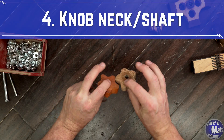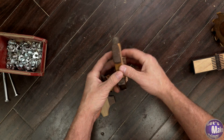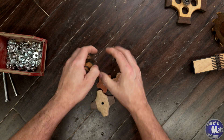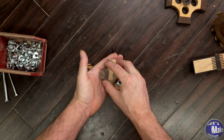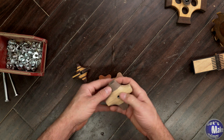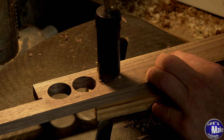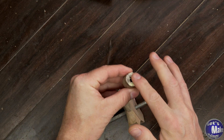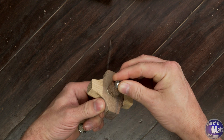One final thought: I didn't add a shaft to any of these knobs. A small shaft on the end allows you to direct pressure more towards the object you're clamping. With a wide knob it can be more difficult to clamp down and release it. Having a little neck on the bottom gives your fingers something to wrap around. If you want an easy way to make one, just use a hole saw — cut a small disc and you've got the shape and the hole in one step. Afterwards, just glue one side of the disc, slide a bolt through it, and thread it into the knob to clamp it tight while the glue sets.